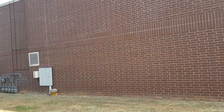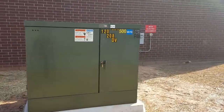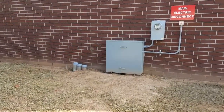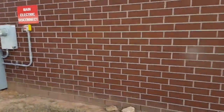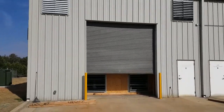We're on the outside of the bigger Bitcoin facility that we've got. Here's a 500kVA transformer that we just dropped in place. You can see it's about 10 feet away from the wall, and we've put enough conduit in to use all the power here coming up soon. It's 208 volts, and we've got about 1,200 amps of 3-phase AC coming in right now.